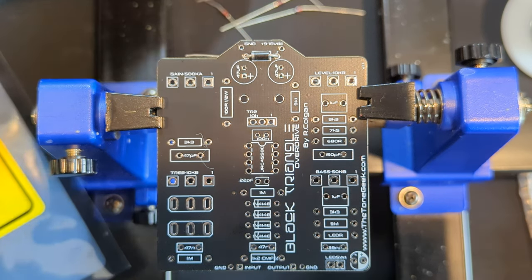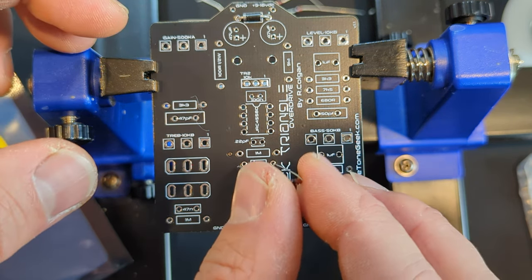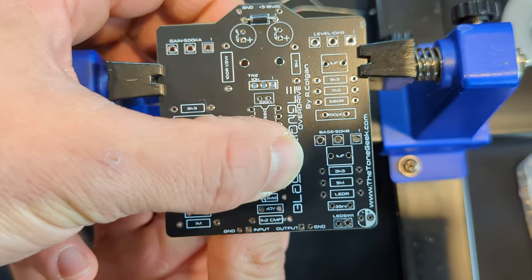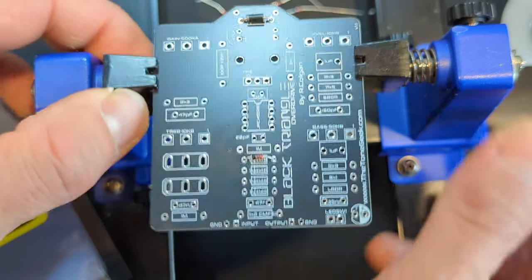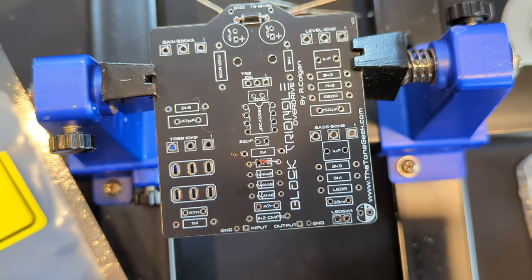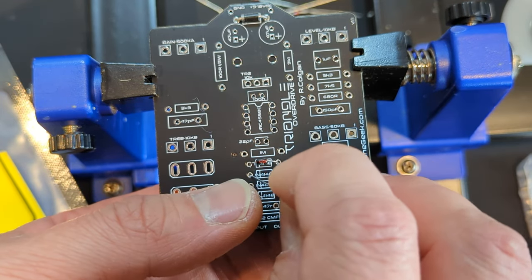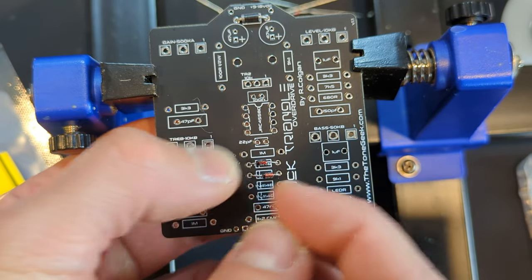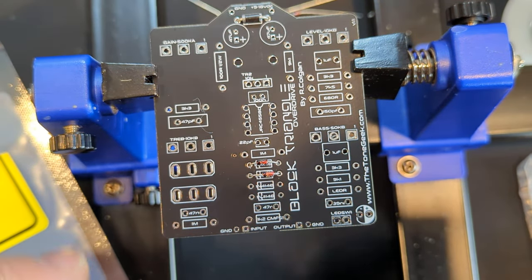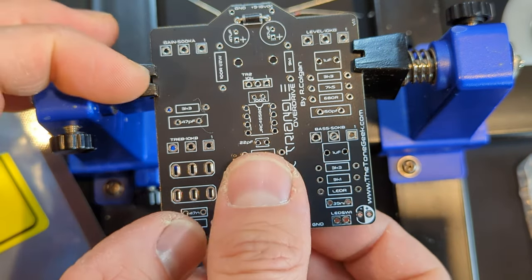There is our first install. I'm going to go through and install all the other diodes, because it seems easier to install them all at the same time. I'm pulling the leads to the side. You can fast-forward on YouTube if you're bored. Make sure the black side of these diodes is facing toward that little band on the board.